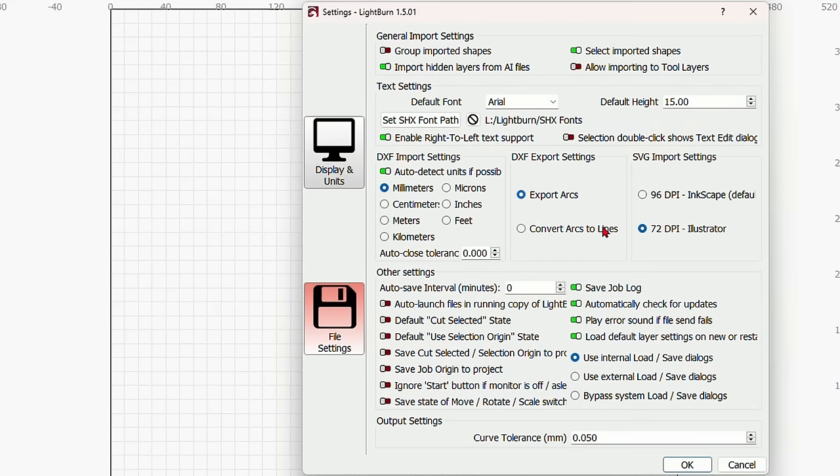Lightburn diode lasers, now diode lasers and CO2 lasers actually, you don't have the actual over-scanning feature in the CO2s because it's built into your controller. But on diode lasers, you will see that this job will work just fine until it gets to right there. When it hits right here, you'll be hitting the boundary of your laser's work area, because this is the scan area where you see in black, and the red is the overscan area.